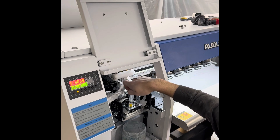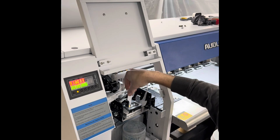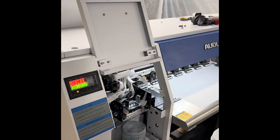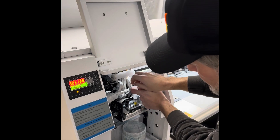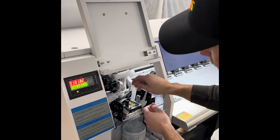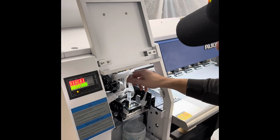I kind of pump it a little bit, doing about two passes each — maybe a third for good measure depending on how I'm feeling. Now I'm going to pull up again. Now that it's semi-flushed and I flushed any chunky stuff out, it's good to pull it up this way. There are screens in these heads, and they only pass particles of a certain size. If there's chunky stuff in there, it has a better chance of coming up this way than down.